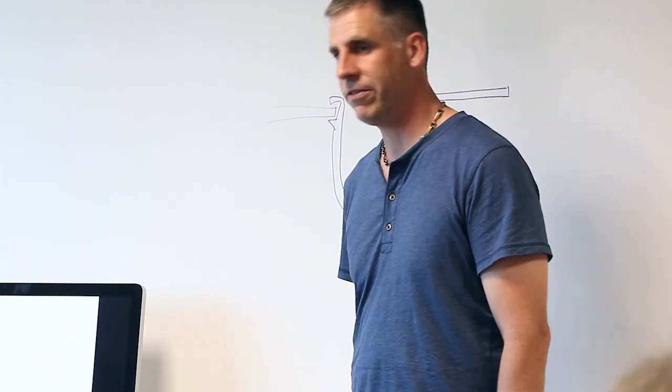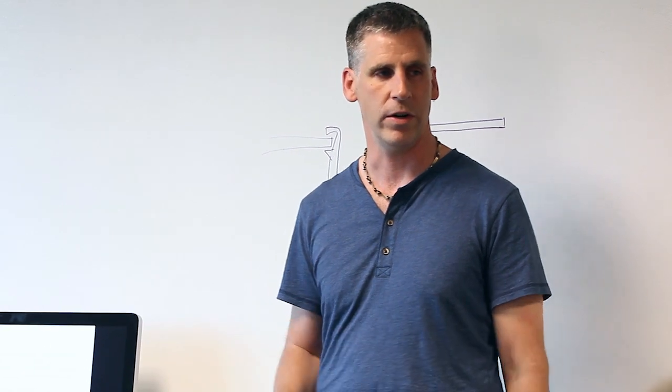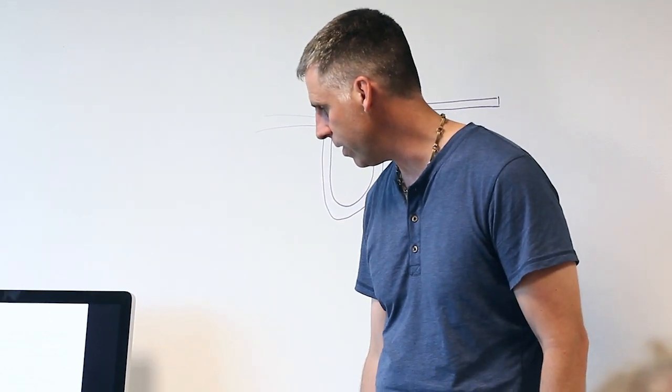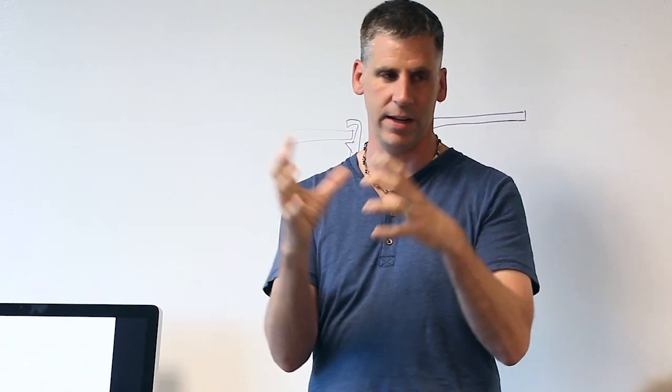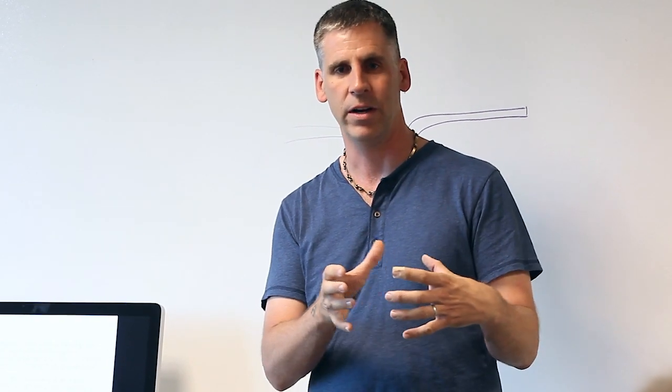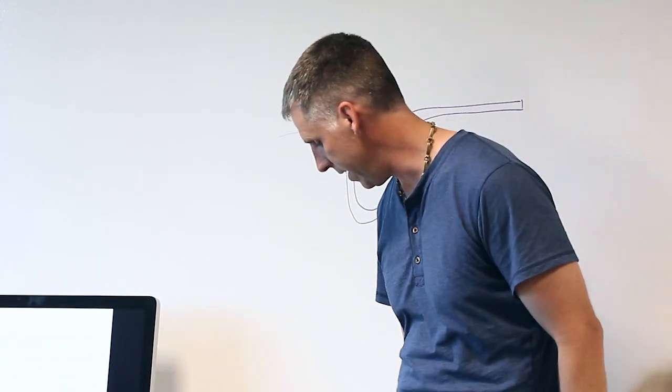And the draft is really a function of the alloy. In general, you'd probably want to plan on about 1 degree of draft for most ones. And typically on an inner core, you'd want to have a little bit more because again, as it shrinks down, it's going to hug that core. Whereas an outside surface, on the cavity side, is shrinking away from that.